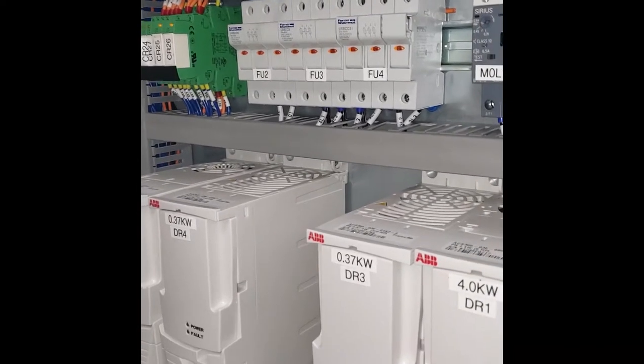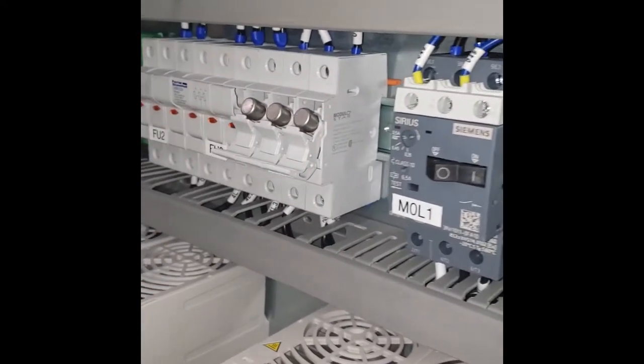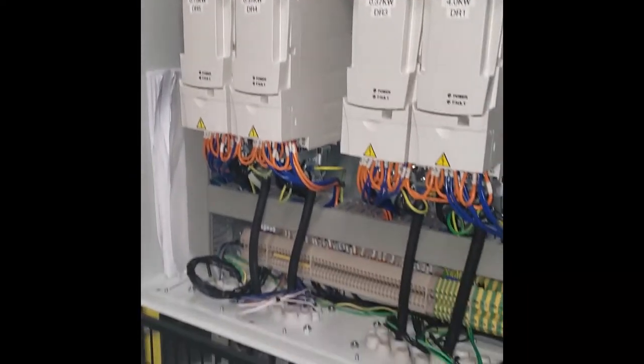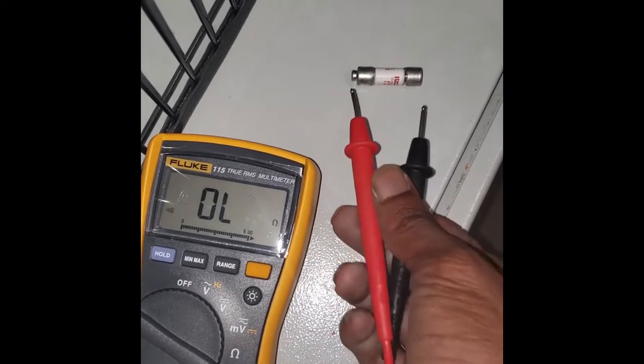Now that we've found our voltage and our voltage drops, we want to take out the fuse and check its continuity. Don't forget, please use PPE because you still have your line voltage coming in. Pull out the fuse, and on your multimeter change the setting to continuity. First we will check our leads — do the continuity test. Touch your leads together; if you hear the beep that means you're good, and you want to hear that same beep when testing the fuses.